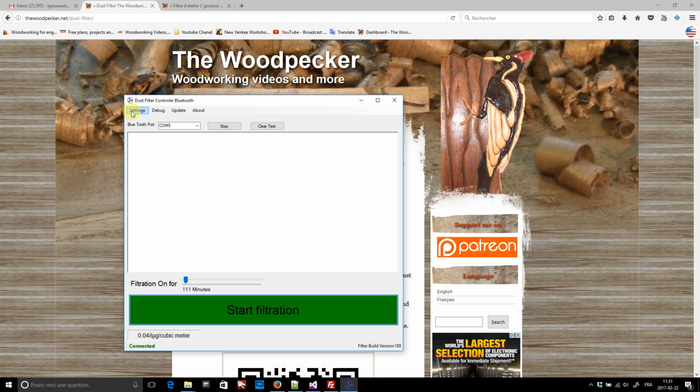Then I have some menus, like the setting menu. First option is the time. You can ask for the controller's time, but you can see it's not the right time. So let's sync it to my computer. To do so, I just have to select Set Time, and now the controller's time is synced with my computer. The same option is available for the date. Then there's the build version. This sends back the same information as if I had sent the command B. RTC just informs you if the controller has a clock or not.